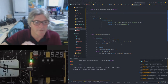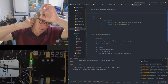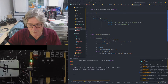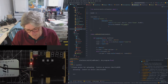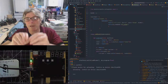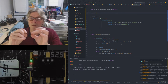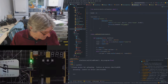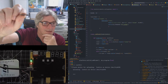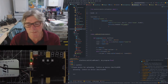What you find is the actual thickness here on the bit that goes in is 0.7. But the contacts in there, if you look, may even be slightly less than that. It's difficult to tell exactly. And then it's got a thicker bit right at the end. And what we're using on the blades are actually 0.8 rather than 0.7, so they're actually thicker. So they should be firmer in there, I'm thinking. There should be less movement, but I'm not convinced.